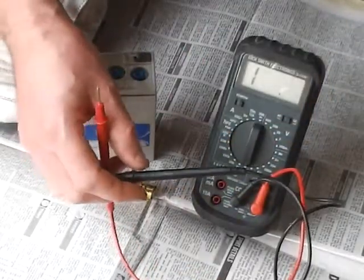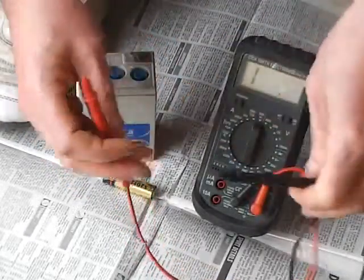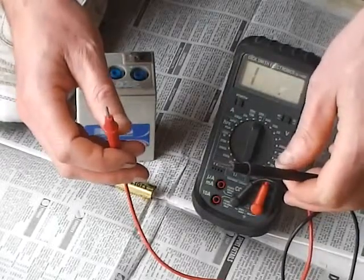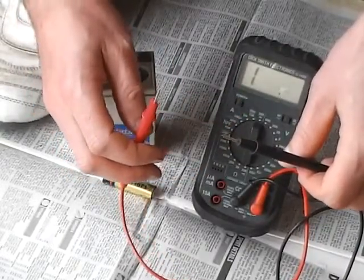And you've got other ones — transistor testing, diode testing, you've got amps. And I'm not certain, so don't try this until you've had it verified, but I think you can stick those on the back of a solar panel on their leads, and you essentially shorten the amps out into this, and then it'll tell you how many amps you've got coming through from the solar panel with that amount of light.